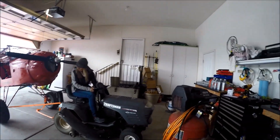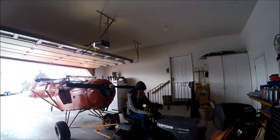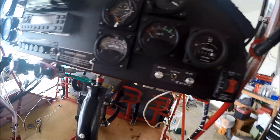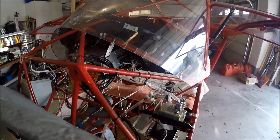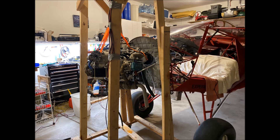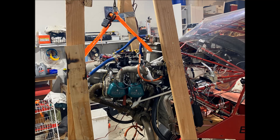After the engine was fully tested, all cables attached, everything looking good with no leaks of any kind, it was time to get the plane into the garage. This is the plane with the Rotax 582 removed. Most of what's on the right of the control panel are 582 gauges — all of that is going to be swapped for the MGL. There's also the ADS-B in and out. A lot of cables are going to go and new cables will come in. The jig has to be wide enough for the airplane nose to go into it, allowing the engine to come in, out, up, and down — very easy.